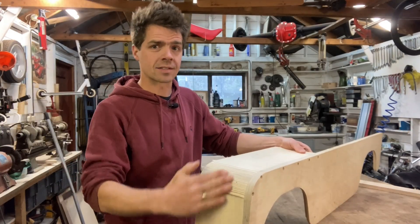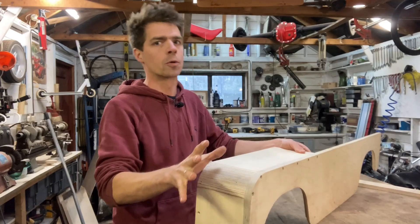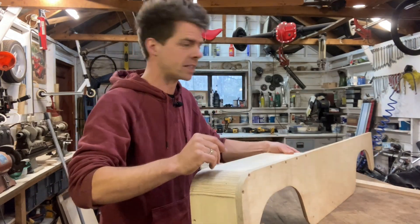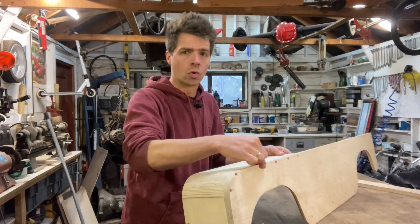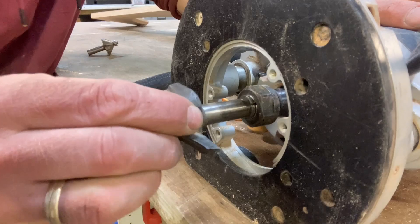I'm pretty happy with this. As you can see, that's the curve on the top of my wing to match the one on the car. There are a few high points and low points but I'll deal with that in the final stage. The next thing I need to do is run a smaller radius all along this top edge, round the curve and down the front wing — again, this is to match the radius on the real car.